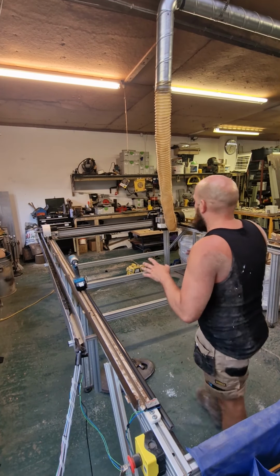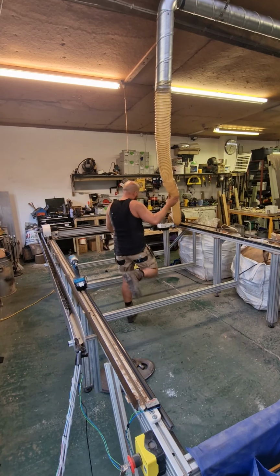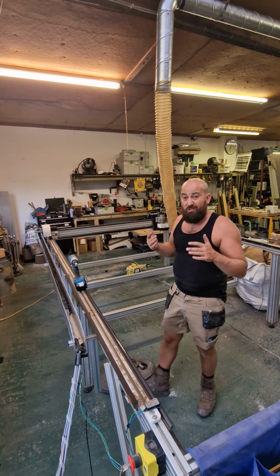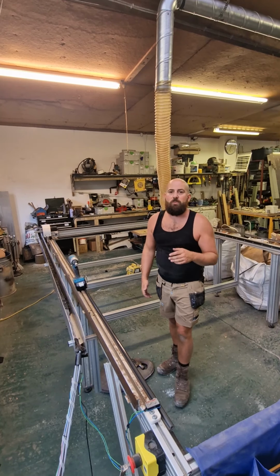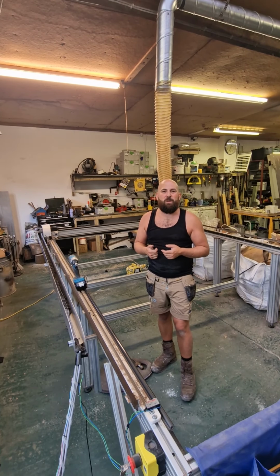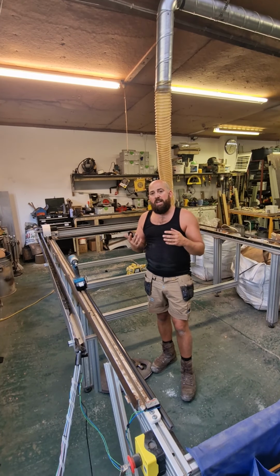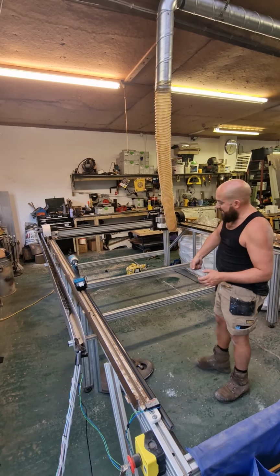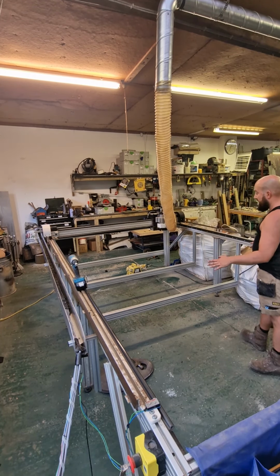So what I've done, just a little recap, is gone down 500mm from the collet because my last depth was 80mm, so it really restricted the CNC to maximum capacity of 80mm, which means that I had to go to the sawmills and ask for everything to be cut at 80mm, and sometimes they came back about 100mm because not every piece of timber, lumber, tree grows the same. So now I've got this awesome depth that I can raise up as and when I wish. I'm probably going to make myself a bed on a jack system that goes up and down from this sort of base.